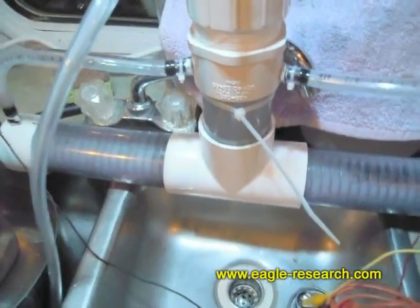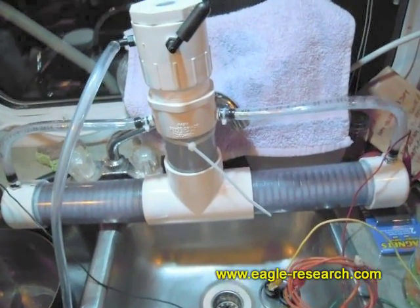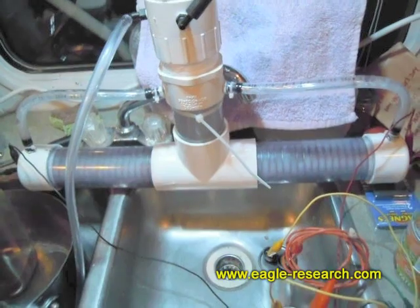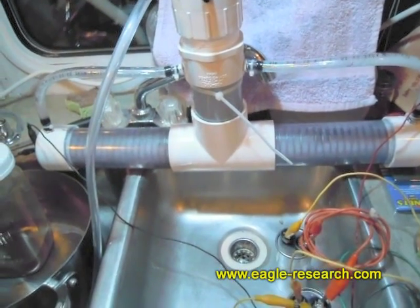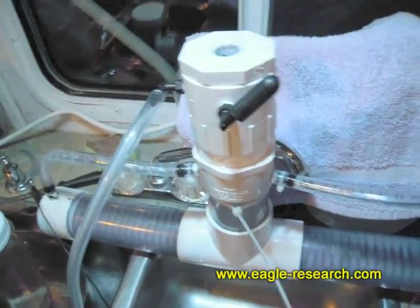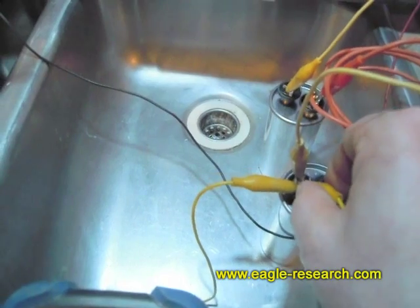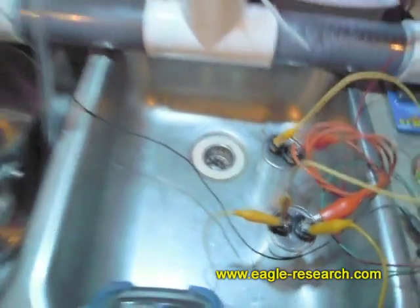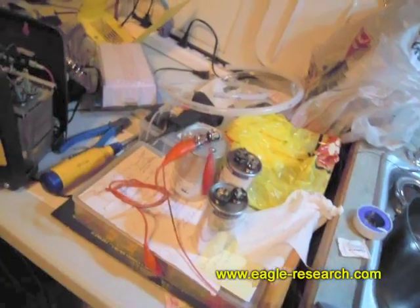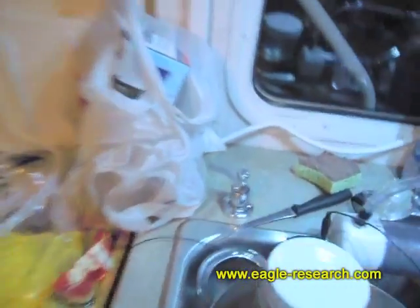You can do that with electrolyzers when you have enough cells on them. I'm just showing you that the ER50 can do that. But it's not as safe, because if the electrolyzer happened to short out on something, it would be a direct short. Whereas if it shorts when it's on the capacitive limited supply, then there's no issue — it's a nice safety thing. So I'll show you that now. We'll shut off the power and reconnect the capacitors like we had before, and I'll get another test clip to actually short out the electrolyzer itself.